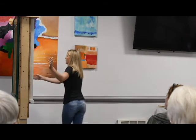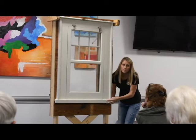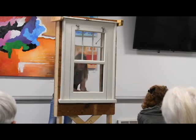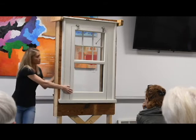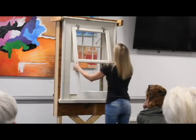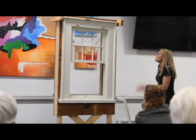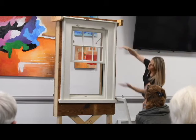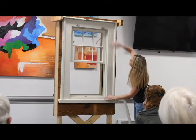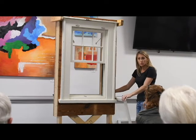When you're looking at the outside of your house, a true historic home will have wooden storms on it. A lot of you will notice these storms, they just hang like this. That's how they're meant to go. In the summertime, you take them off, and your house looks like this, and some people have janky plastic shutters nailed in here, and some are this big, and some are this big, and you go, why doesn't that look right? Because this little recess in the sill and up here in the jamb is meant to fit shutters or storms, wooden storms, and it fit right in here.